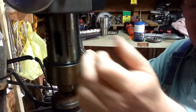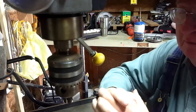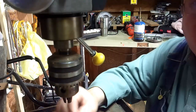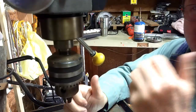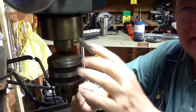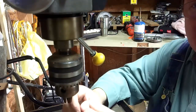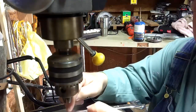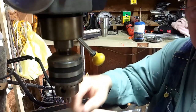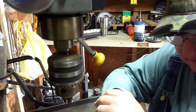What I'm mainly concerned about converting this to a mill—my number one concern is: when I'm cutting sideways, will that cause the taper to come loose and the chuck fall out? Because that happens. My little Craftsman drill press over here—the chuck comes out regularly. When you're milling, you've got a piece of metal and a bit coming right to the side of it. What happens is it causes chatter, and that rubs back and forth until this gets loose and it just pops out.